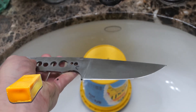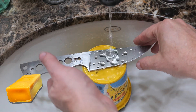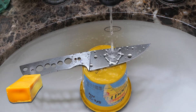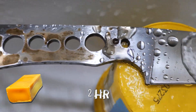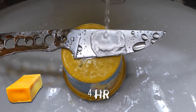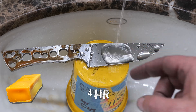First up on the drip test is the carnauba wax. I just put this in my bathroom sink and drip water on it, checking every hour or so. At one hour it's looking really strong. You can already see rust starting over on the untreated area. At four hours, I check the backside — the backside has been exposed to standing water, and these edges are probably going to cause some rust where the knife contacts the edge.